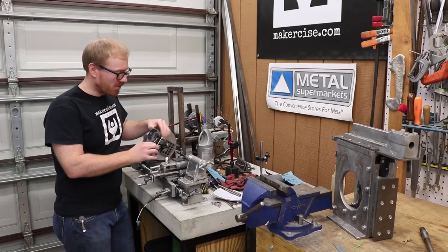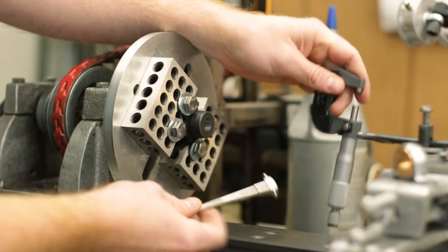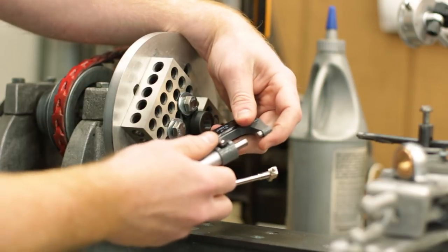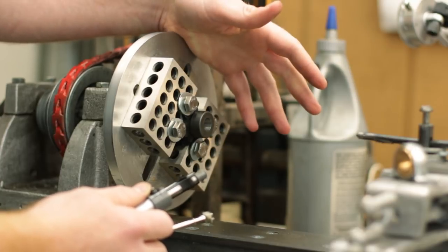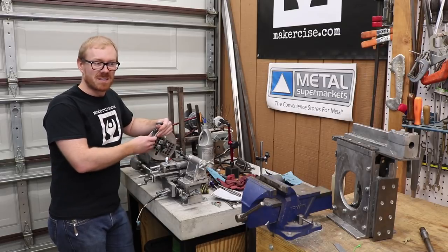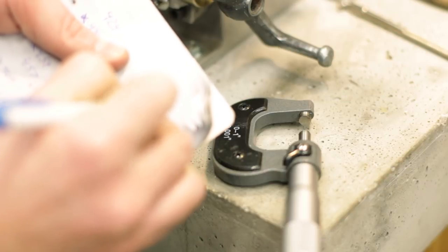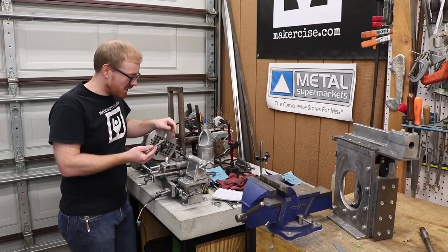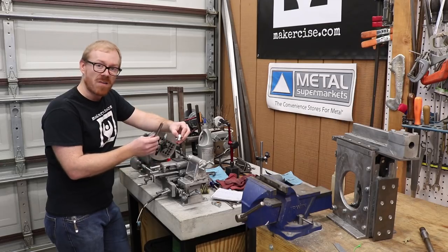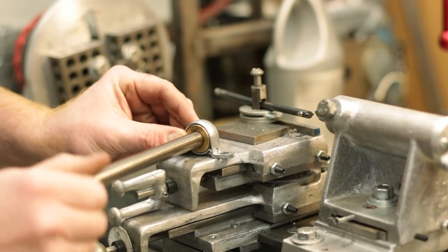I'm really happy with how this boring operation turned out. I used my telescoping bore gauge, as well as my caliper, to help me ease in on the diameter that I'm looking for. These 1-2-3 blocks, the caliper, and the telescoping bore gauge — I'm going to put links down in the description because I really feel like these tools help me get what I'm looking for out of this lathe. I got within maybe half a thousandths, plus or minus, from what I was targeting, which is two thousandths over this gauge bar that I'm using. This is 500 thousandths diameter, and that fits well in this bearing that I'm going to be using.